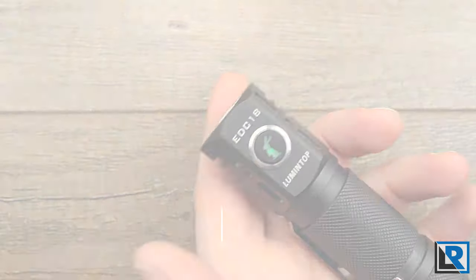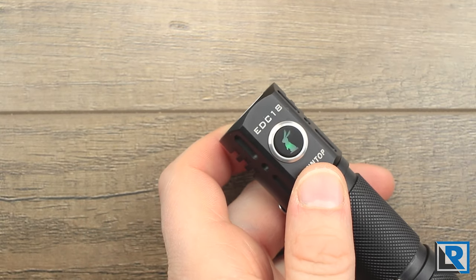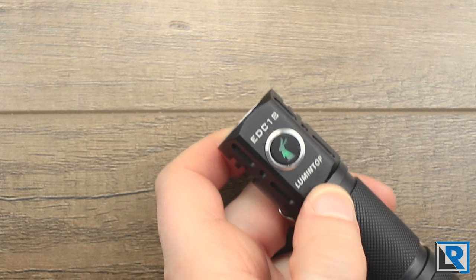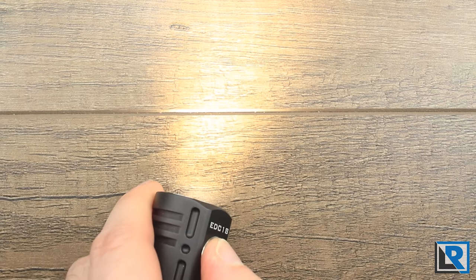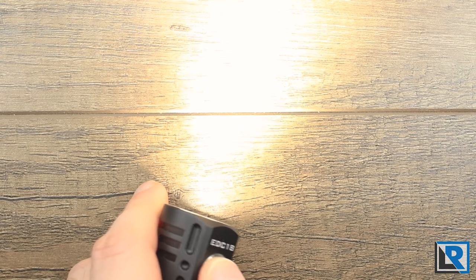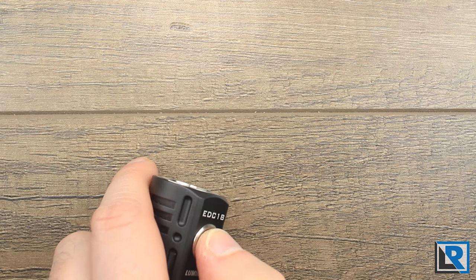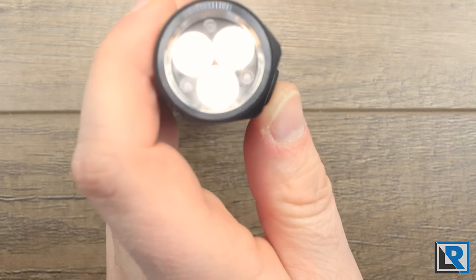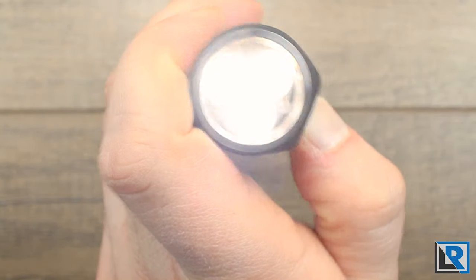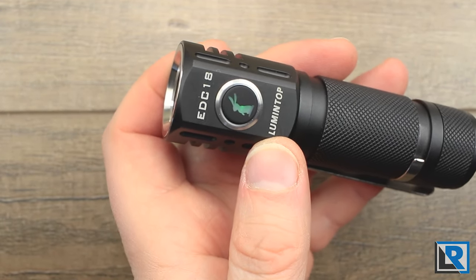This light works best if you use the ramping firmware and only bring it up to the power you actually need, minimizing heat and maximizing runtime. This light uses ToyKeeper's Anduril UI, currently one of my favorites, with a ton of options and Easter eggs that commercial UIs typically don't have. By default, it's in ramping mode — turn it on, press and hold and it clicks to let you know you're at the top, double click to go to turbo, click again to go off. Once on, press and hold to come down. There's also a stepped version of the firmware that's easy to switch to.